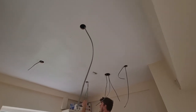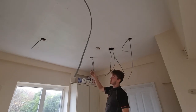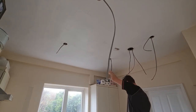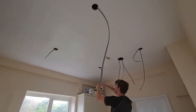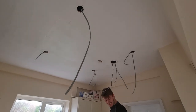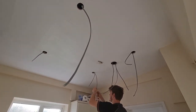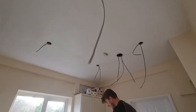I've seen people mark the joists, make holes either side, drill holes through them, cut the spotlight holes, pull all the cables in, and end up with about ten extra holes to fill and patch. If you just mark and measure your spotlights out first, cut your holes, then think about your wiring route, you can do it pretty simply. Matthew did want to make another hole over this side when he wasn't really thinking — and he was also going to leave half the kitchen lights disconnected because he couldn't figure out those wouldn't actually be wired at all.